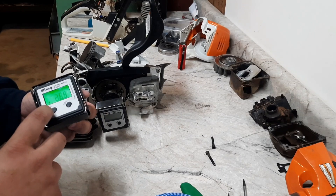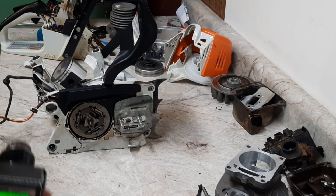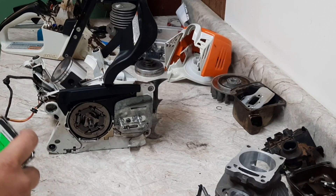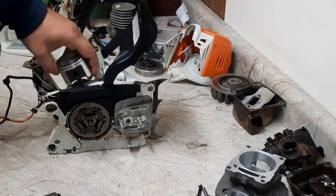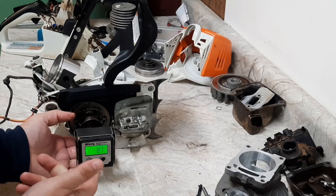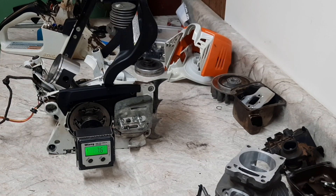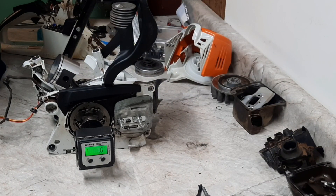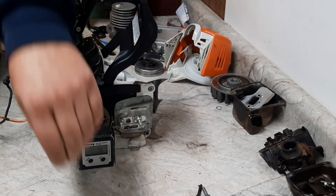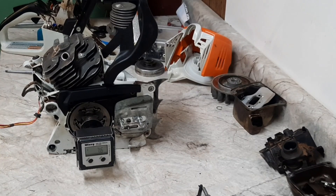This is just the rough bare bones version I've been using for quite a while. These are listed on the website and I've had a handful of people ask how to zero them, how to set them up, how to read them. This is a 500i I'm working on. What I like to do is set the piston all the way up to top dead center, mount the gauge so the numbers are pretty close to vertical, tighten it down, then use the chuck key. I normally go off the clutch side. Slide the cylinder on with at least bolts in opposite corners so you know you're in the correct spot.